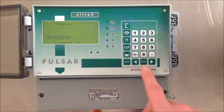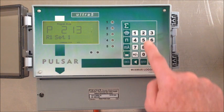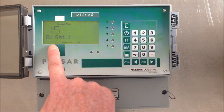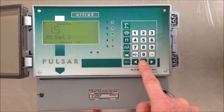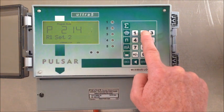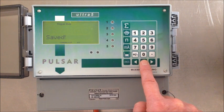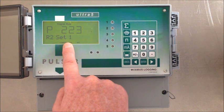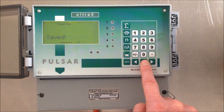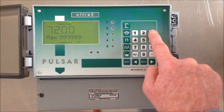For more options, hit enter — this is where we're going to configure our relays. Relay one, set point one — this is our common off-level point, which wants to be 1.5 feet. You'll also note it's asking for the information in feet because we've asked it to be in feet. Now, as that level in that tank begins to rise again, we want that relay to switch off, so we're going to set the off-point to 2 feet. Relay two, set point one — this is the on-point for the lead pump. In this case, we want that to be 4 feet. And then for the off-point, anywhere below that 4-foot mark will do, so we can make that 3.5 feet.